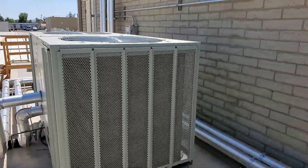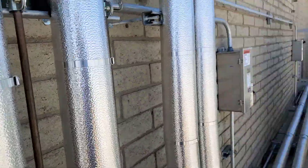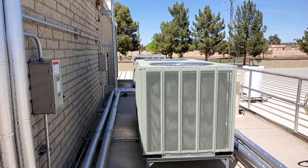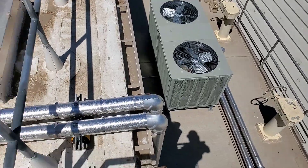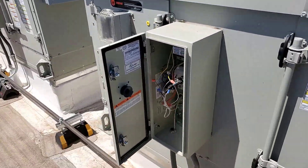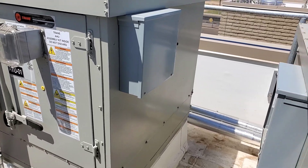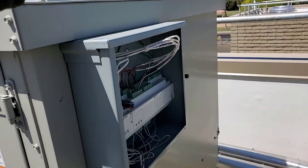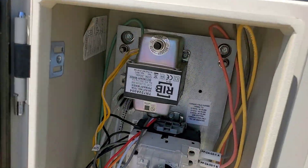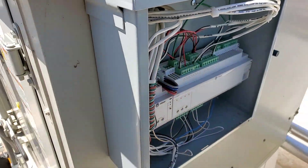With that disconnected off the Trane controller - there are two plugs for 24 volts, both going to the same terminals inside. This one is dead, no LED. Resetting now - there's my green LED. The Trane board is now powered off the transformer down here. The two transformers were probably out of phase or slightly different voltage from one another, causing them to pull crazy current fighting each other. Coming up the ladder - I already hear the blower starting. Now this unit is definitely running off the transformer down there. I'll remove the extra transformer.